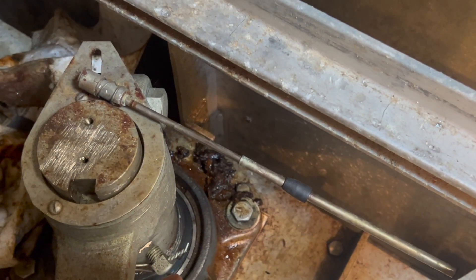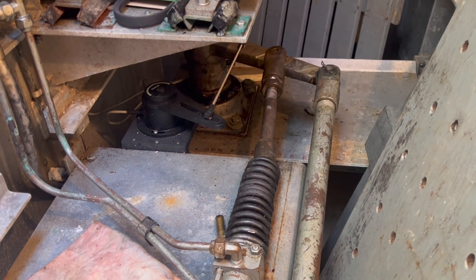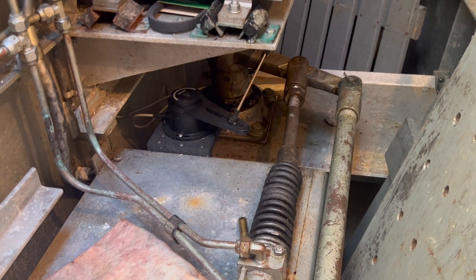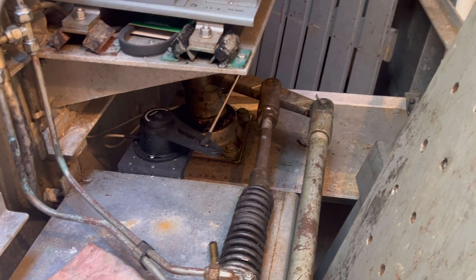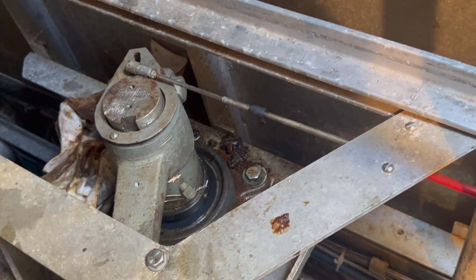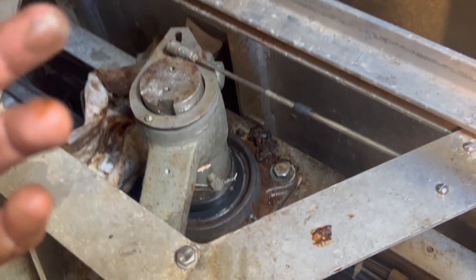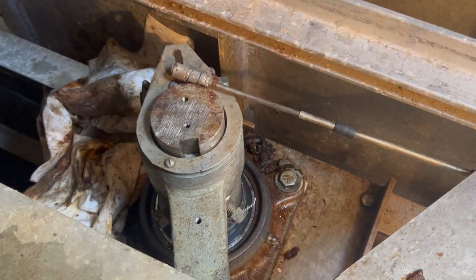It really shouldn't be bound up underneath. It looks like water may have been getting on top of the bearing. I put the ram back and tried to use it — I've got 40 pounds of pressure and I can't move it. But with the chain fall I was able to move both sides. I just need to get them loosened up, re-hook everything, and get the steering moving. That's the job for today before charter.